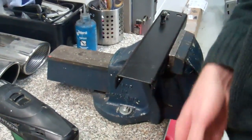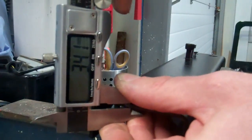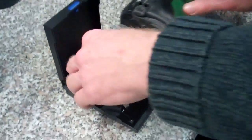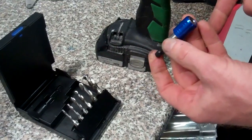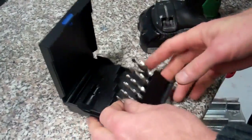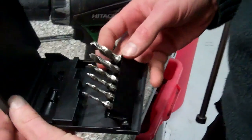This is pretty tough steel — I think they'll work better in aluminium, obviously quicker there too. This steel is about three to three and a half mil thick, so it's a reasonable bit of steel. Ian did the first one — I haven't used these before. Do you reckon it's worth using a bit holder or just put the bit straight in? You can use them straight in the drill, either or. And if you want to do different sizes, that one is quick release.